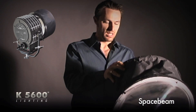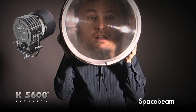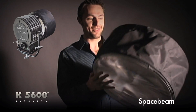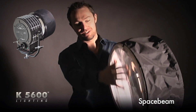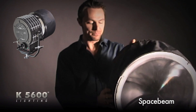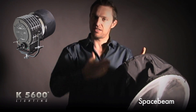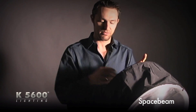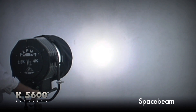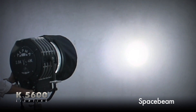The first thing to notice is that there's actually a plastic lens in the front — you can kind of see it makes you look a little funny when you put yourself behind it. There are short poles that surround a lens ring with this plastic lens, and it slides in front of the Alpha 4K just like a set of barn doors would. With a Fresnel lens inside the Alpha 4K in addition to this plastic Fresnel lens, it acts as an intensifier and you get a nice tight three to four degree spot that gives you really long throws, similar to what a par will give you except you're using a Fresnel.